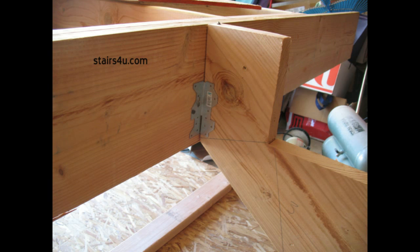That sheathing provides horizontal strength — side to side. If you're looking for vertical support or vertical reinforcement, then A35s or joist hangers would definitely provide you with that.